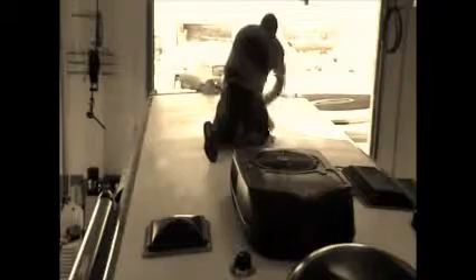Now you want to take the panel, lay it down exactly where you want it, and make sure it's placed right. You'll want to cut the bottom of the paper and pull off about two to three feet of it, as you see being done here. Stick that bottom edge down, then roll up the other side, pull the rest of it down, and it should flop right exactly into place. Make sure you put pressure on all parts of the panel so it's down firmly.